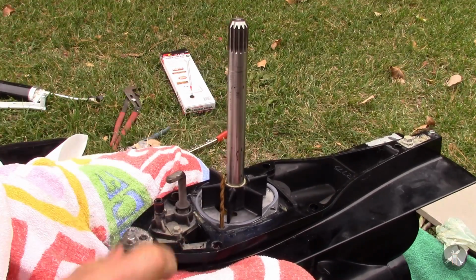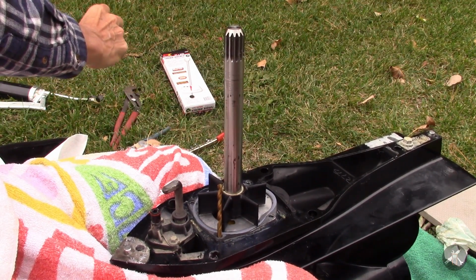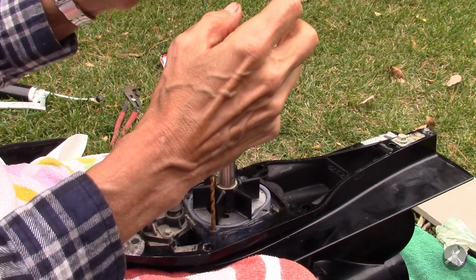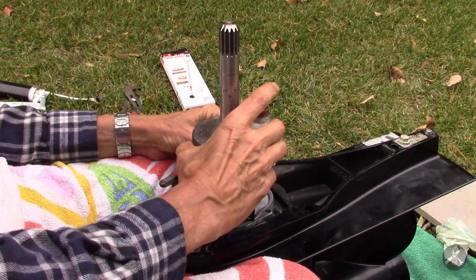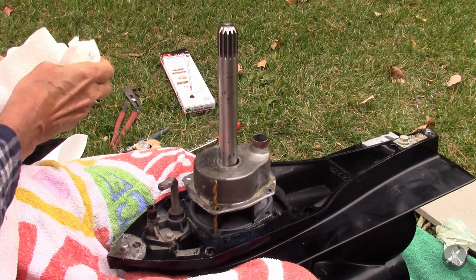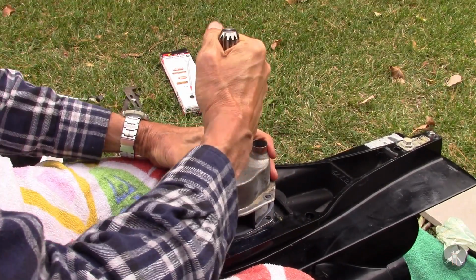At this point, the impeller is down over the key. It's locked to the shaft. And then for this one, with a standard rotation housing, you rotate the shaft clockwise while pushing the body down. So what you end up doing is put this down over the pins. I've done this without pins, and it'll drive you nuts in the end. The best thing would be some 5/16 threaded bolts with the heads cut off that you could finger thread in, but right now I don't have those.